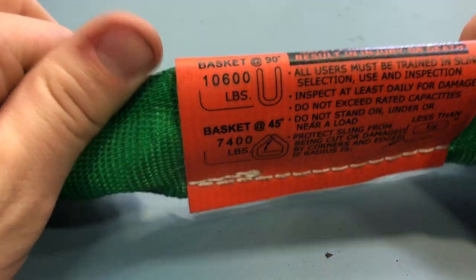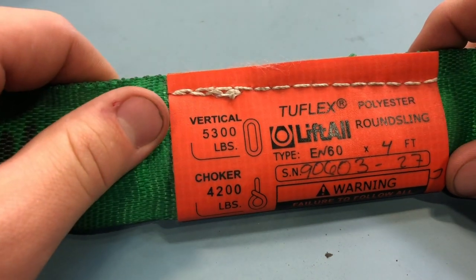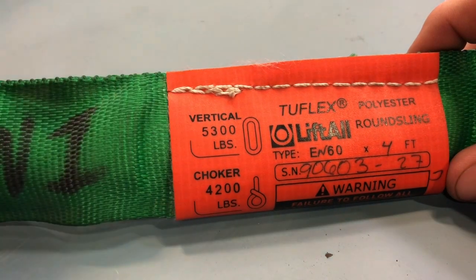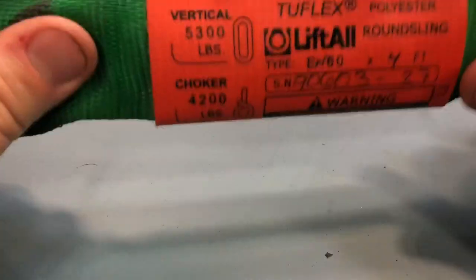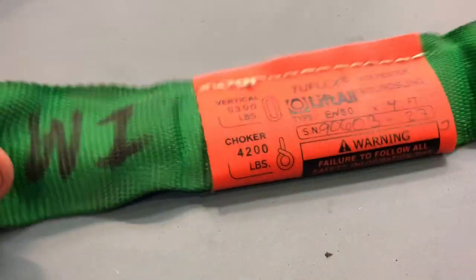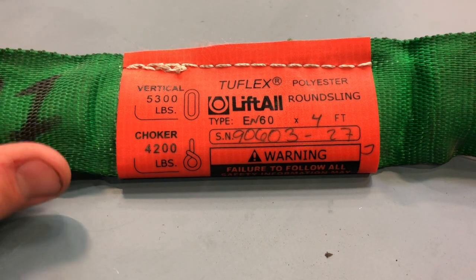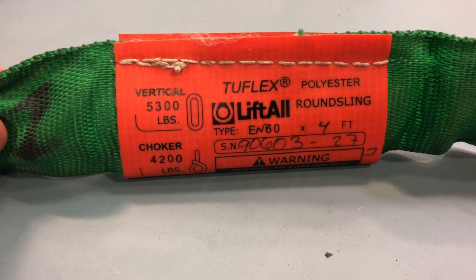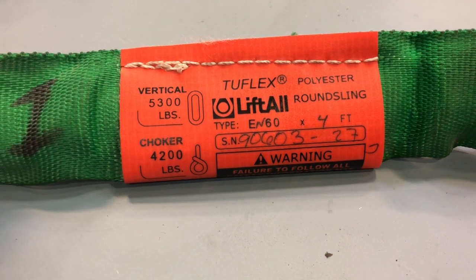All right. Otherwise, make sure you inspect your straps and do not pick anything that has any sharp objects. If it does have sharp objects, I want you to grab some sort of softener. It could be a piece of wood, a piece of cardboard, anything like that, just to soften that corner from the straps, and that way it won't wreck it. The reason I grabbed these green and blue nylon straps we got hanging around is because they're probably my favorite. They're easy to get looped around different objects. You're welcome to try other stuff. I recommend staying away from the chains. I'm just not a big fan of hoisting with chains, mainly because it can ruin something that we're working on. So be careful.